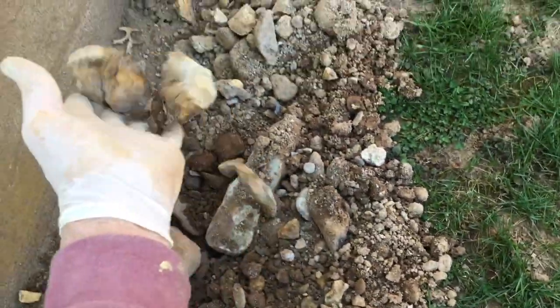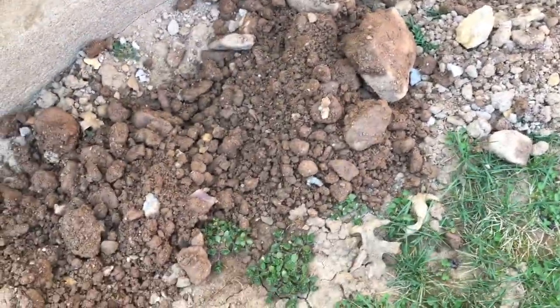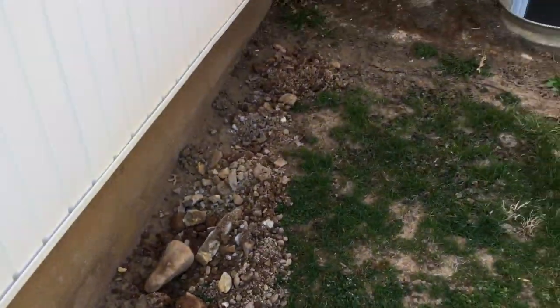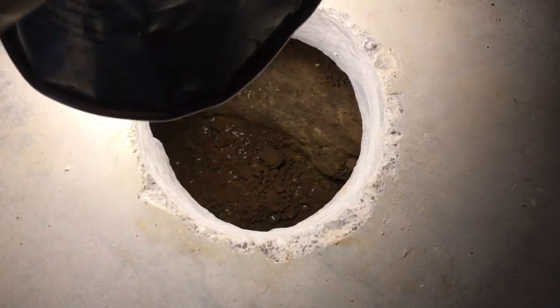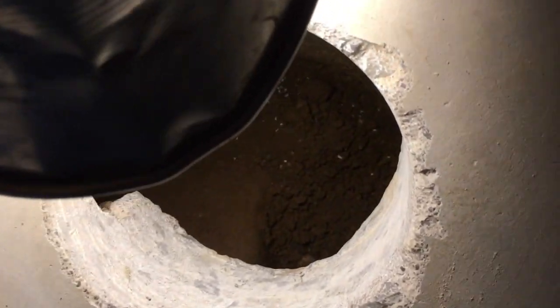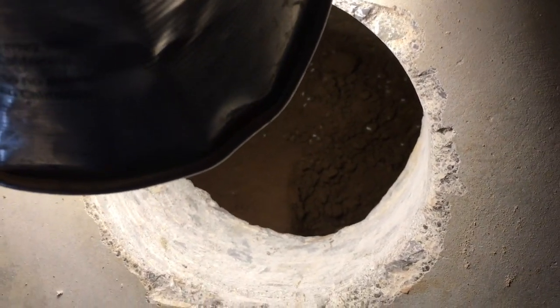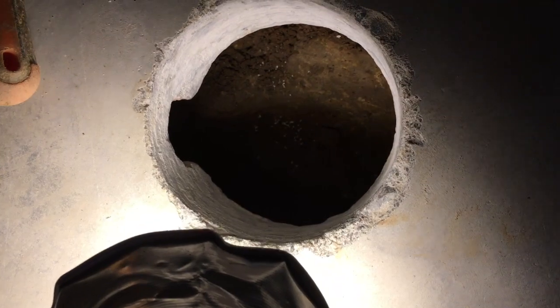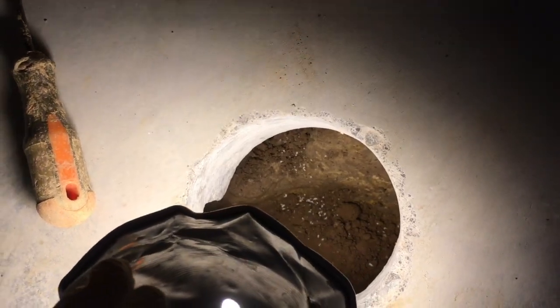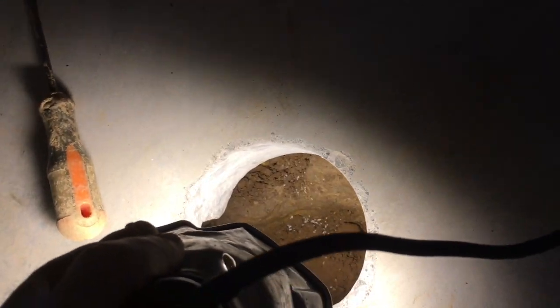Here's the actual material I was pulling out of the hole — I don't usually see it quite like this, so it's a little unusual for me. What we had here was dirt and big stones — that is a monster right there that I cannot budge. A good rule of thumb when you're removing dirt, debris, and rocks from underneath the slab: if it will wiggle, it will come out; if it won't budge at all, you're in for a battle.